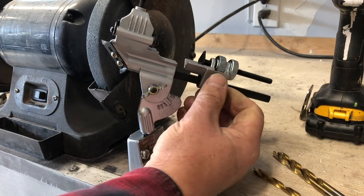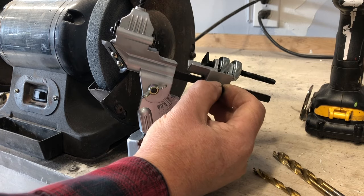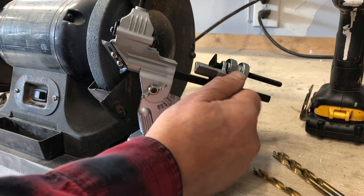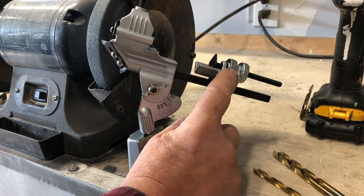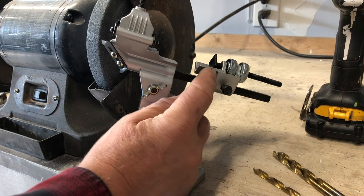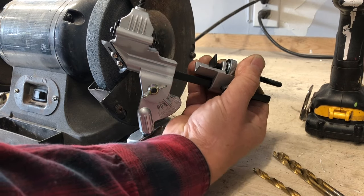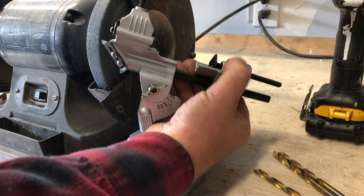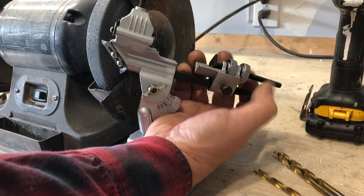This is to do gross adjustments when you put your drill bit in there. These two here are for fine adjustments — to move this little plate back and forth, you loosen off the back one here, adjust back and forth very gradually, and then lock it by using this one.